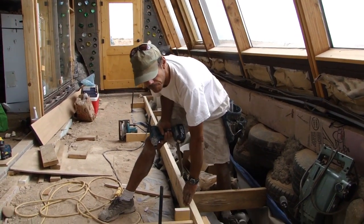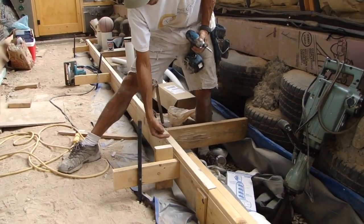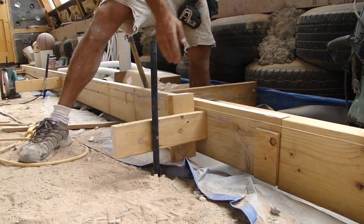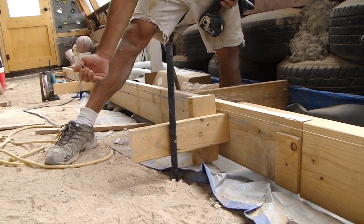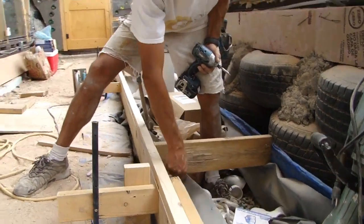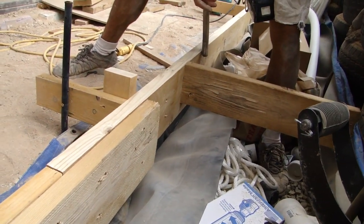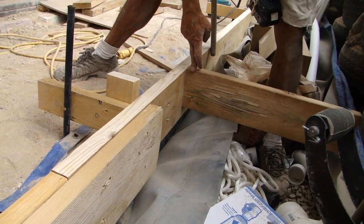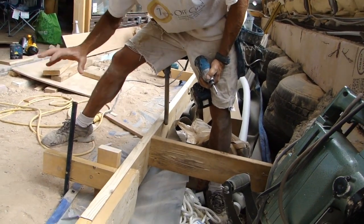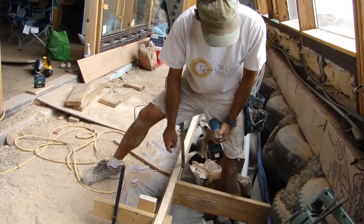We're building some formwork here to pour against the concrete. It's set at the height of the finished floor, and basically we're creating a straight line so the concrete terminates itself to create a nice edge for the planter. The planter liner will come up against the finished concrete pour. Since we have to get rid of these temporary form stakes and form supports because we're pouring here, we have to transfer some of those form supports to the back tire wall here.